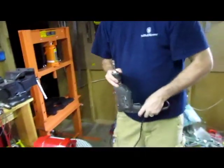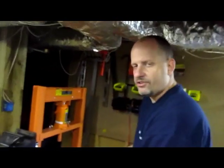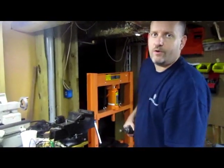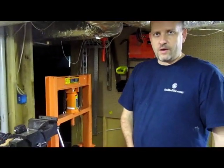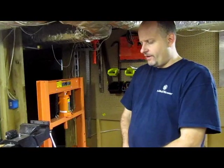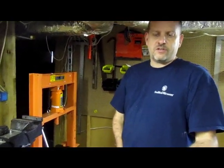We get lots of — this is just a basic segment here. We're going to show you a little bit about torque and what that means to power in the next video. So what we have here is an open voltage test. This is what you see on the top end of a lot of charts. If we said this unit could put out two or ten amps, and we see this particular PMA rotating, this open voltage will go well over 300. By those standards we could say this is well over a 3000-watt PMA — but it's not. We'll show you what it'll do in a minute. Let's look at what this PMA will do on open voltage.